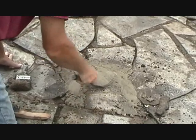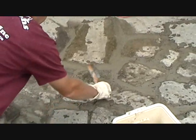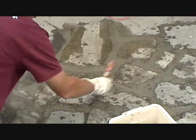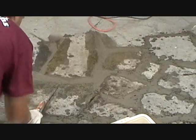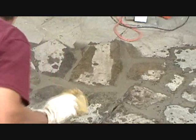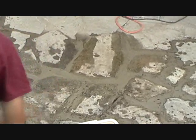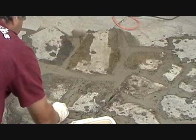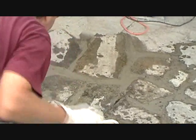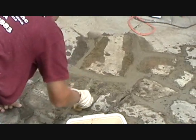And that's it. Then you wait a while. We'll come back a little later with the sponge and sponge it up. Now, some of these joints aren't coming out — you can't get them out. So all you do is just rub the joint with the wire brush to get it out as best you can. Then you put the sponge in, kind of wet it a little bit, take the wetness out of it. Then just get a little dab of cement with your rubber glove and shove it in there with your fingers. You're kind of painting the joint on one side. Then just get the sponge and wipe the joint off, like that. It kind of fills in all the holes.